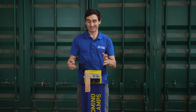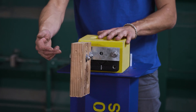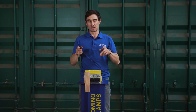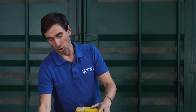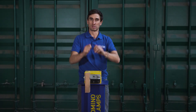As you saw, that was a great deal easier than the other method of attaching timber to a domino clamp, whereby we would bolt the timber directly to the domino clamp. There's no need for a pillar drill, there's no need to try and get those holes perfectly lined up with those on the domino clamp. This is quick, it's easy, you don't need to be too precise with your drill. This will make your builds a lot quicker, especially when working on site — if you've got timbers top and bottom you can just offer up the timber, drill your hole through, and bolt it together.